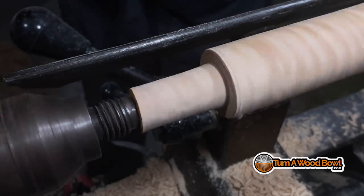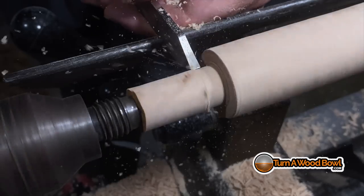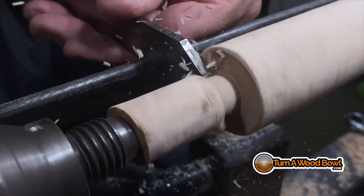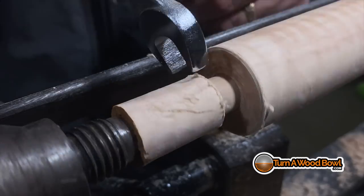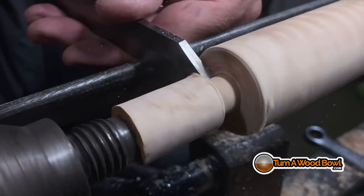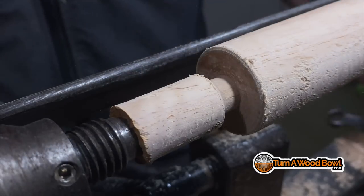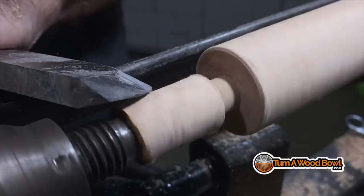This section of hickory taught me quite a bit. It had a very long, heavy cantilevered limb coming out at about a 90-degree angle. The trunk below that limb took on all the weight and pressure, and the grain inside that trunk had compression in it. That compression translates into what's known as fiddleback — these beautiful rippled patterns that appear in wood. Fiddleback is named because it's the wood veneered and used for the backs of fiddles and violins.